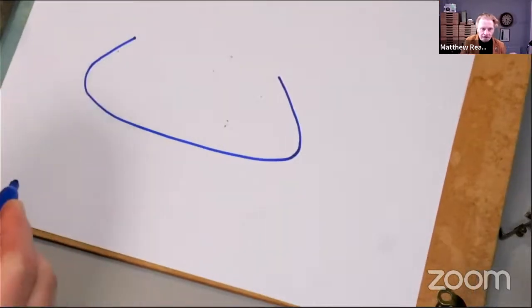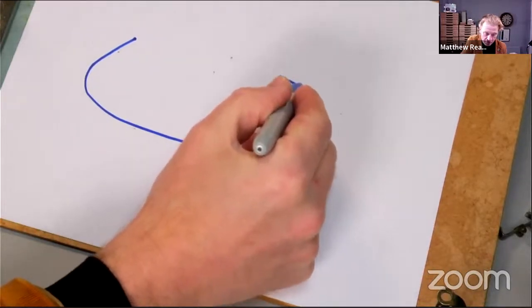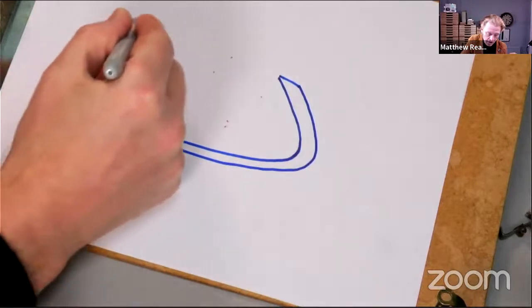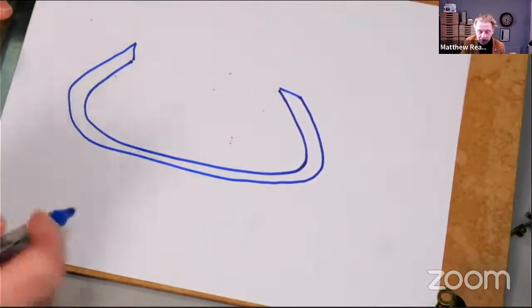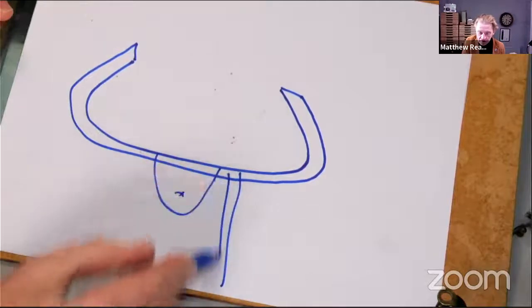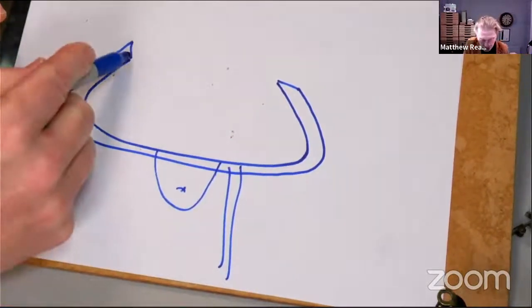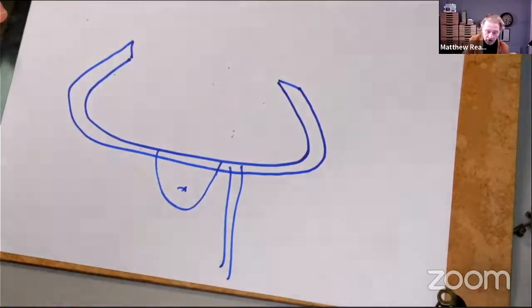And the exit pallet is here. So we've got an impulse face there that goes around there, and we've got an impulse face there. And what's happened is this is squidged over. So here's our little thing, and here's the crutch.